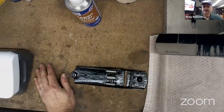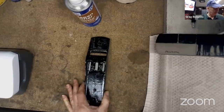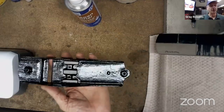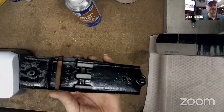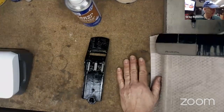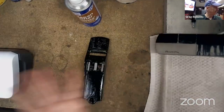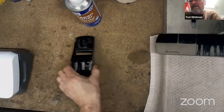You can still dent it but not very easily — you have to press pretty hard. It's not tacky at all, so it's about 90% cured, which is better than I've ever seen this stuff cure without heat. The Japan dryer is definitely making a difference. It looks like it's going to be about a three-week dry at room temperature, and it's been out in my carriage house in the low 60s.